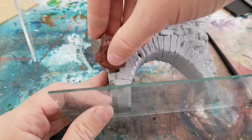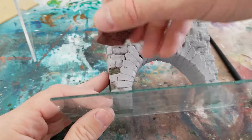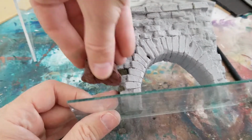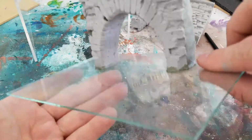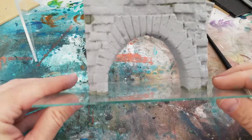But anyways, I'm gonna make a mold box out of this piece of plexiglass here, and I'm gonna do a dump mold on top of the piece. Where I did most of the work was around the feet, because I wanted this piece, where we're gonna dump in our molding material, like plaster or resin or whatever, this way. So this area will be flat. That will level off. I wanted it to have nice flat feet down there.